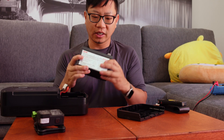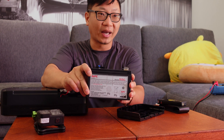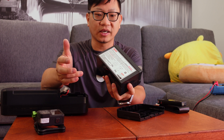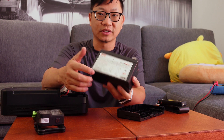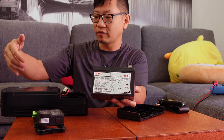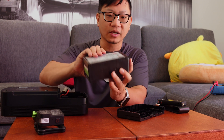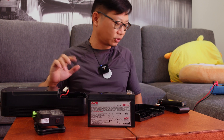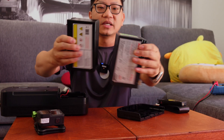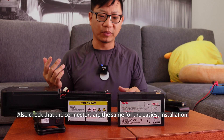What you're going to do is go online and look up your UPS battery pack. You can Google the actual battery pack you're supposed to be using, or you can get an OEM version or a third party. I got a third-party battery pack that was designed to fit this completely. If you search on Amazon for the actual UPS battery pack, there would typically be a bunch of different choices. I chose one in the mid-range — I typically don't choose the cheapest and usually stick with a name brand I have experience with. Before you purchase, you can take the battery out and measure it with a ruler to ensure the fitment is fine.